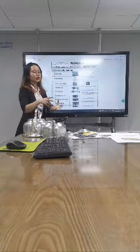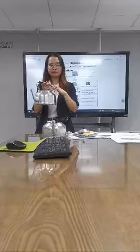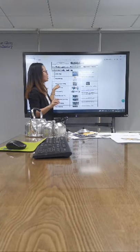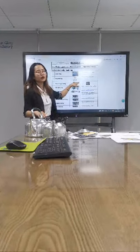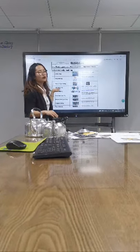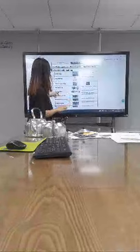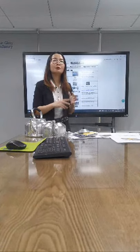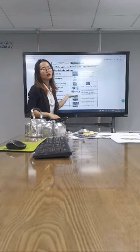And after shape forming, it has some burrs on the edge. So need to cut the edge. So need to vertically cut the edge of the kettle. So after cutting the edge, next is the binding of the kettle. So after binding, what should we do? Need to wash it, remove the oil, right? So go to this whitewashing.